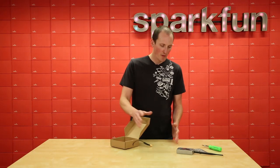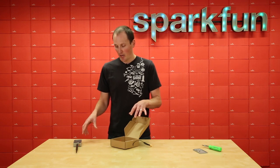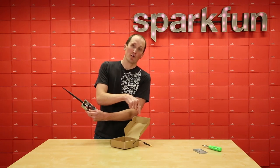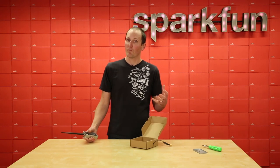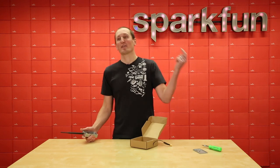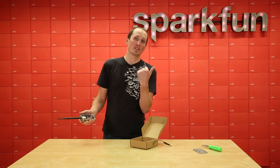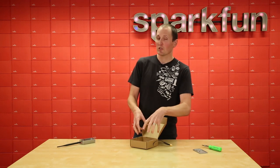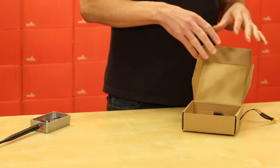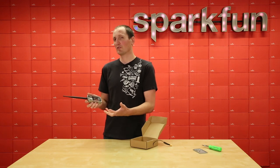What's fun about this system is that these cryptographic coprocessors are adding a really high level of security. What's actually happening is a couple of handshakes. I press the button, this remote sends a ping to my garage. The receiver hears that and says, okay, somebody wants to open this garage — I'm going to create a new random token and send it to the remote. The remote hears that random token, then it digitally signs the token and returns that signature. The receiver hears that signature and can verify that it's good to go. And the only place in the world that that signature could actually be created is right here inside the cryptographic coprocessor. That's what makes it super secure.